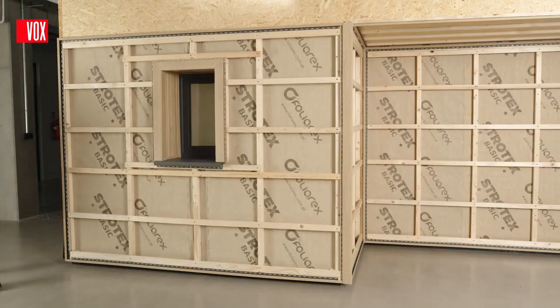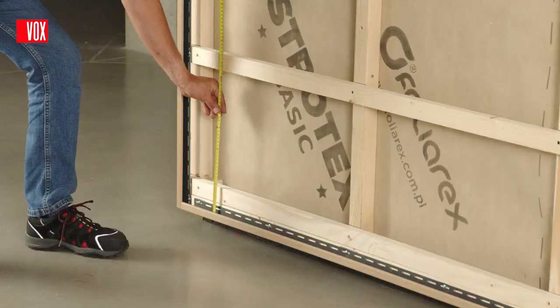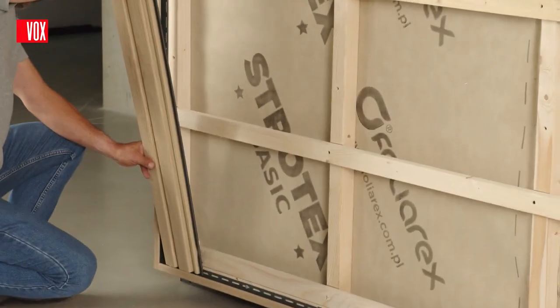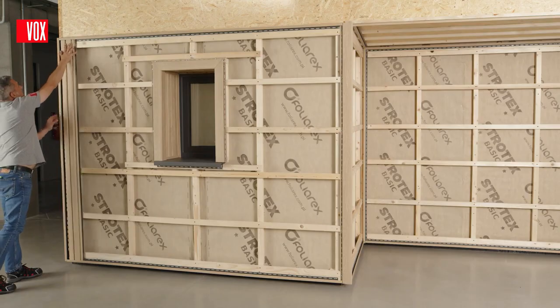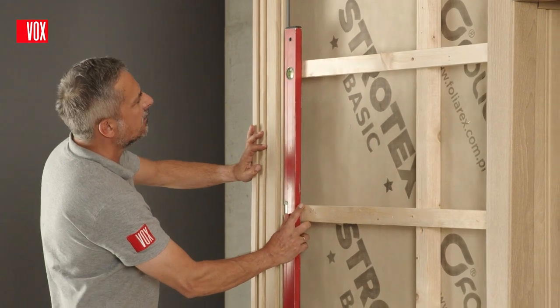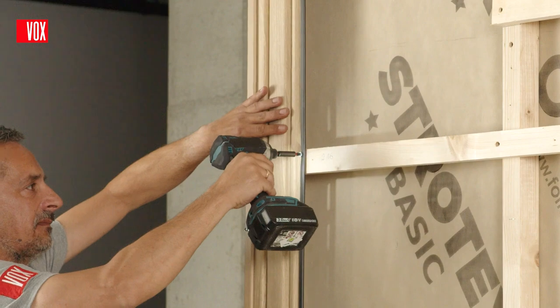The panels should be installed from left to right. Measure the required length of the panel, remembering to keep a suitable expansion joint in the trims. Cut the first panel to length and slide it into the trim. Level and then lock the panel with 2 screws on the second batten from the top.